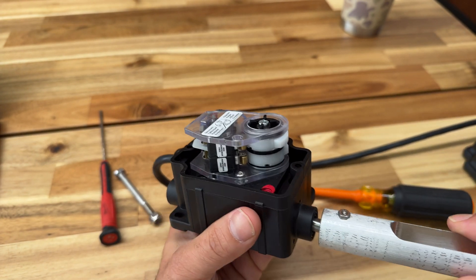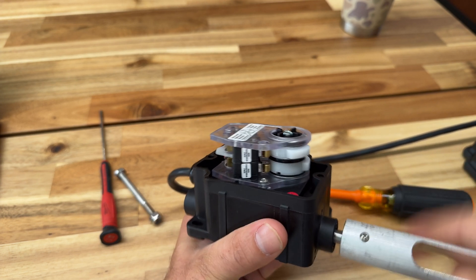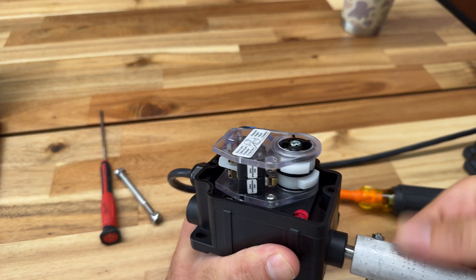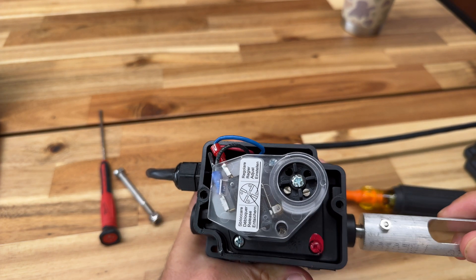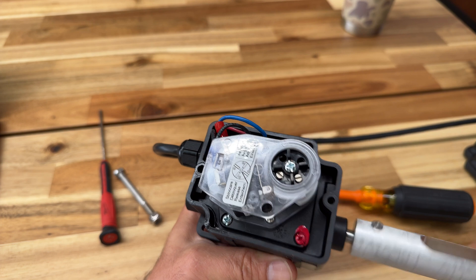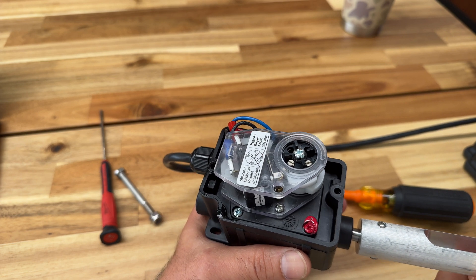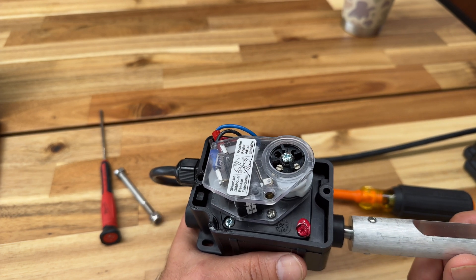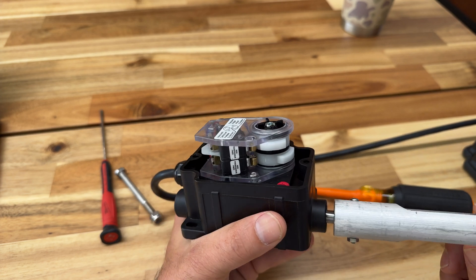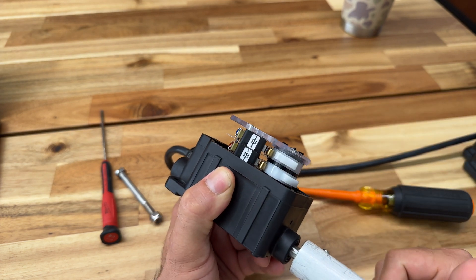Spinning it the other way, see how it's gaining closer and closer — and as it gets right on that rotor, you hear that little click. Now, if your lift is stuck in an upper or lower position — or stuck on both — that means you can't go up or down without using an override, whether it's a TEC, a GEM, or a Premier remote. Anything with stuck contactors, meaning both being depressed at the same time, will not let the boat lift go up or down.